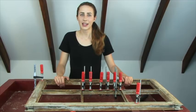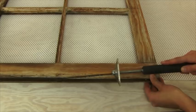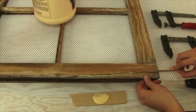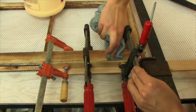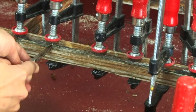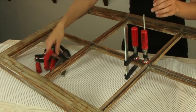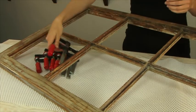If you need to make any repairs, this is a good time to do it. Avoid all epoxy fillers as they will eventually fail — use exterior wood glue. Wipe any excess glue and clamp securely from different angles. Here we are just doing a simple repair, but a dutchman or a splice — basically replacing the damaged wood with new wood — is the most effective way of restoring an old window. Be sure to allow enough time for the glue to cure before moving on.